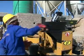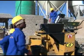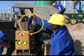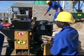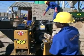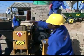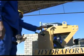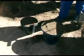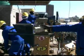The Hydroform machines can produce one block every 14 seconds. During block production, the block length is measured with a measuring stick to ensure consistency. The machines are simple to operate and even unskilled persons can easily be trained in a day or two to operate them and produce consistently high quality blocks. The machine's hydraulic levers are operated manually to eject and compress the blocks. Half blocks are made by using a smaller 5 litre bucket. No special mould is required and the same machine and mould is used for half block production.